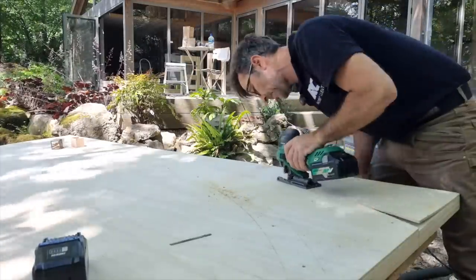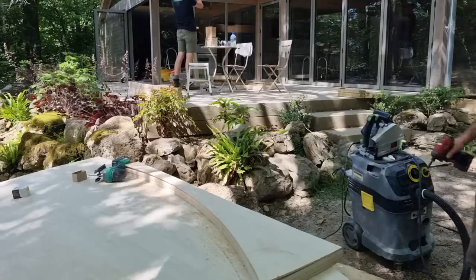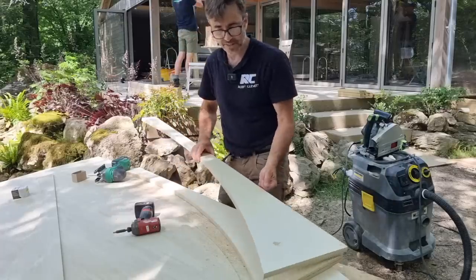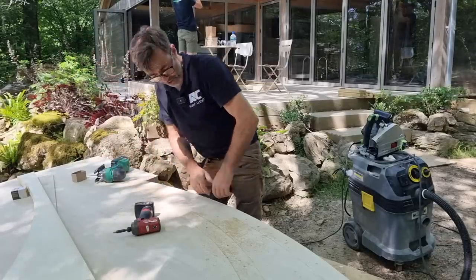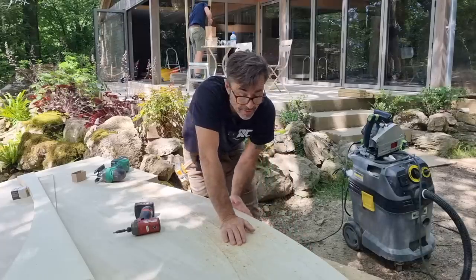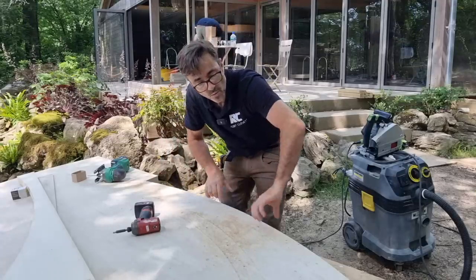The jigsaw handled the job quite well. I did use a new blade for each cut because this Streetech ply literally takes the edges off them. That's the first cut - the first edge. I'll discard these offcuts and clean that edge up now while it's still on the board and more solid. I'm going to use a combination of a coarse-grit sander and a spokeshave and a little plane, to take out some of the lumps and bumps. We don't have to be too fussy because it's a really wide radius.